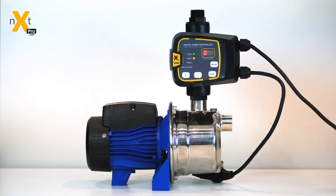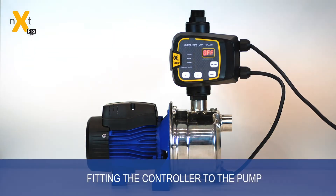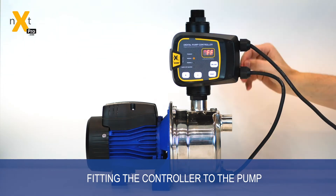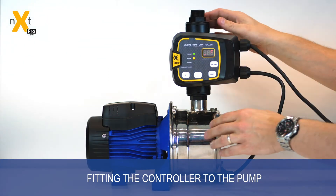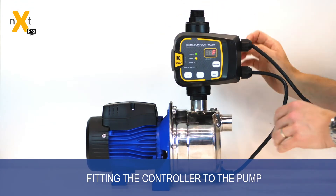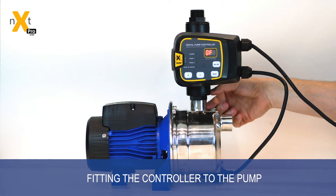The first key area of the NEXT Pro Controller that is very unique and one of the technical aspects that you need to be aware of is the hydraulic design. Under the NEXT Pro Controller series, all units come with a removable one-inch fitting on top and bottom — a swivel fitting that allows the controller to rotate without breaking the seal, and also allows for the controller to be installed without a union.